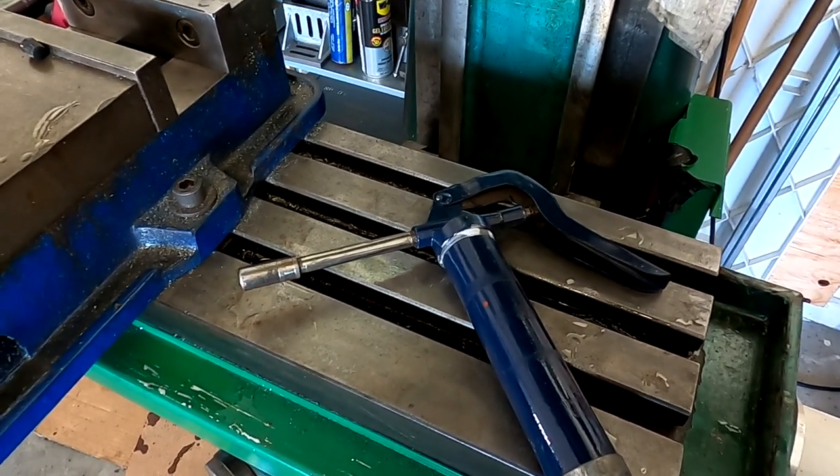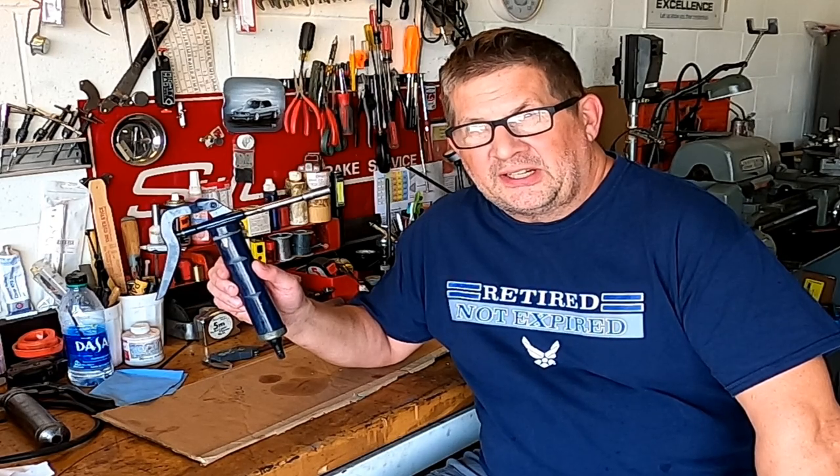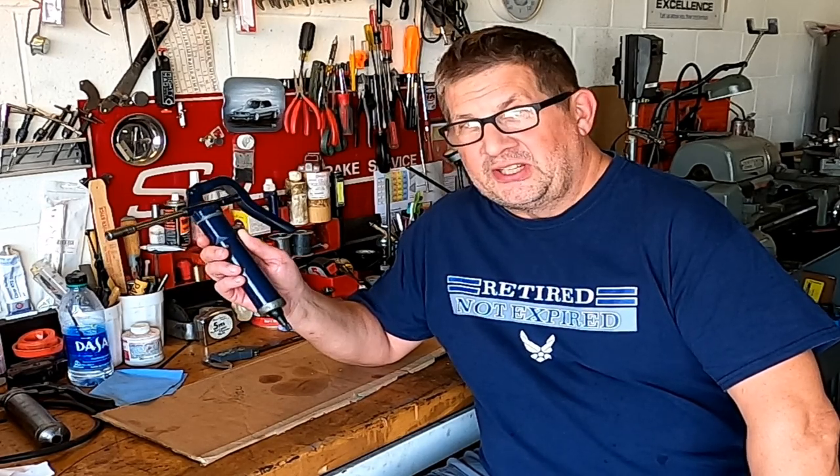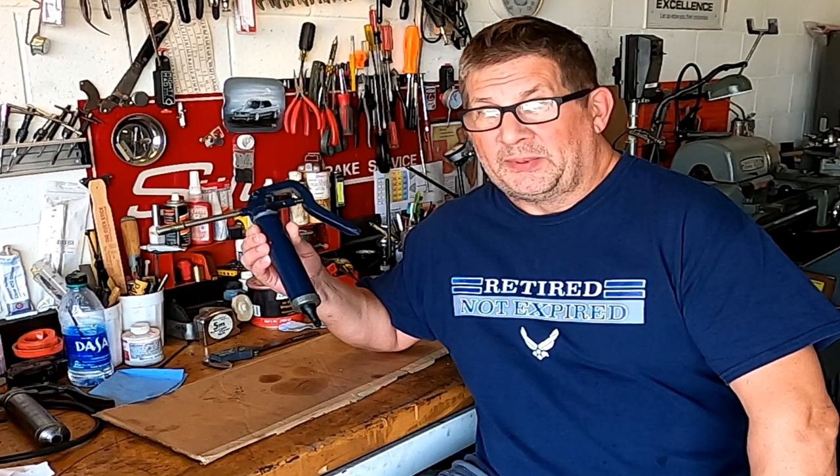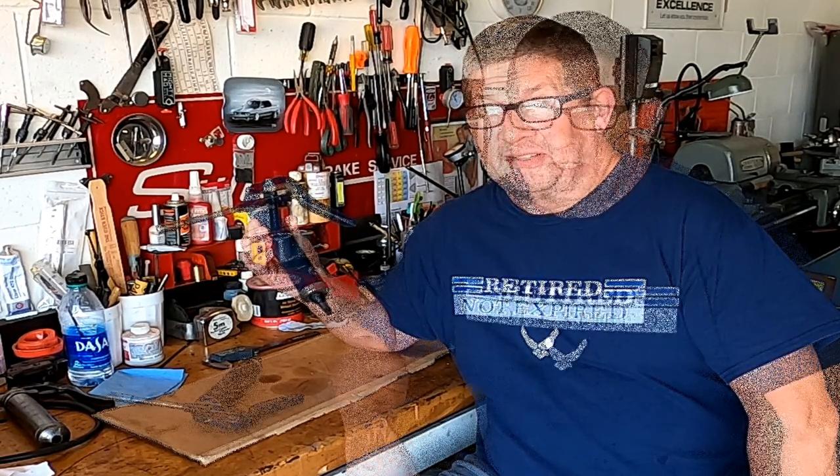That's about it for this. I hope you all enjoyed putting together one of these oiling guns - I've found them very useful and very cheap to make. I buy the grease guns for a dollar a piece at the flea market and as you've seen they're very easy to put together. The last thing I'd like to share is a mistake I made: my air compressor regulator was still set at 120 PSI. Normally I have it dropped down to around 30 PSI for blowing chips, so I was injecting way more air than needed. Honestly it only needs about one PSI to function, and when your regulator is set at 30 it's very easy to control it at a lower PSI. I was probably dumping 75 to 80 PSI into this. From Florida, Don out.